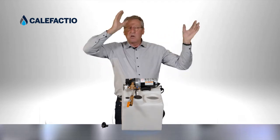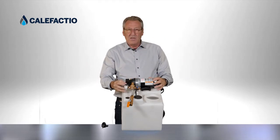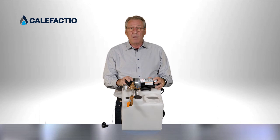That liquid — as the air goes out — is going to take its place. When it goes back to 13 or 12 psi, the pump may not run or may run a little bit, but you've stopped the short cycling of the pump. As easy as that. Thank you.